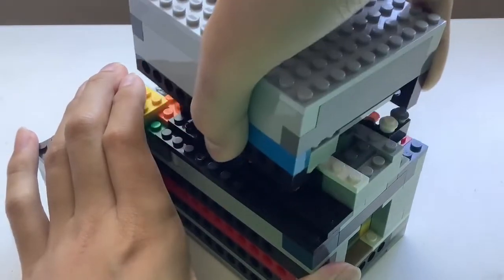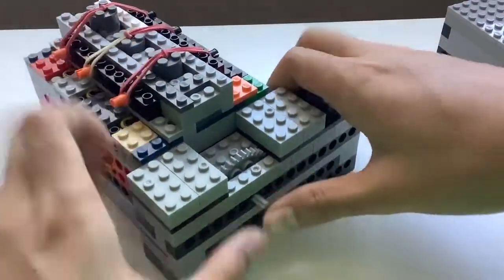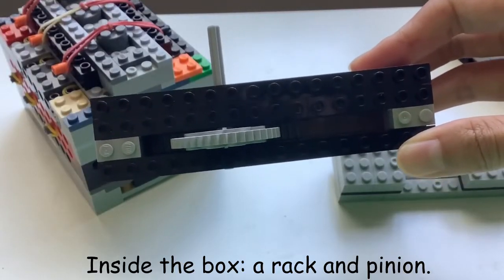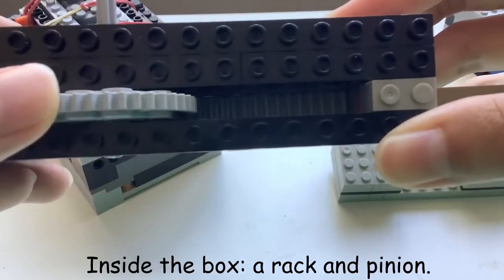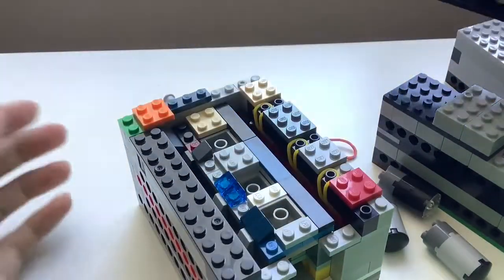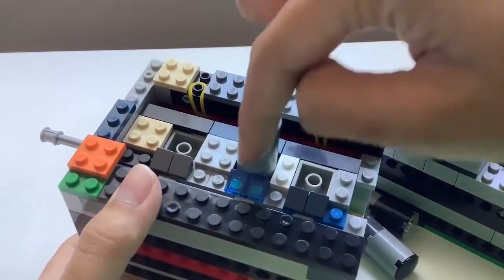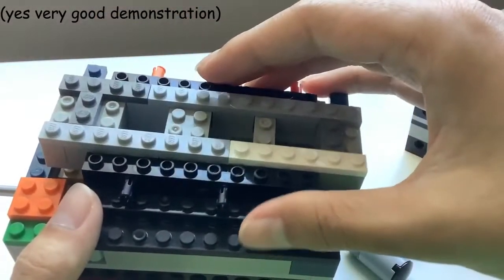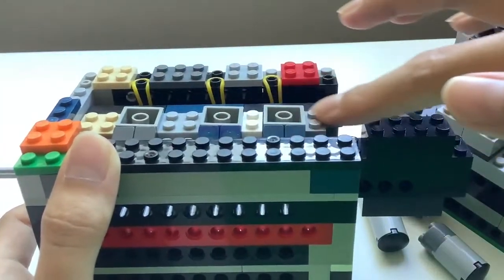Now onto the real lock. Once I take off the top, you can see the rubber bands pushing down the driver pins. I have to remove this attachment at the back — all this does is turn the rotation of the plug into the linear motion of the bar. You can see that this mechanism is separate and it can be modified for whatever application you want, although you probably don't want to apply this lock anywhere. If I remove the driver pins and another layer of the casing, you can see the key pins and the plug. As mentioned before, when the key is too low, the driver pins get stuck, and when the key is too high, the key pins get stuck in the middle layer. With the correct key inserted, all of the pins are lined up and you can also see how the entire plug rotates.